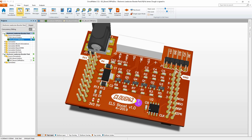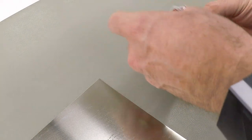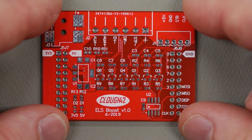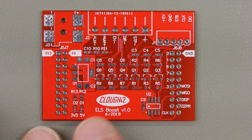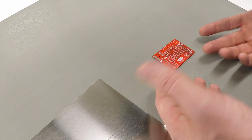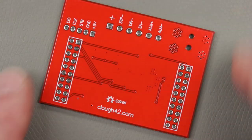I sent this design off to the fab, and through the magic of planning ahead, the boards are already back. These are the boards as they came packaged from the fab. I had these made at JLCPCB, which is offshore in Shenzhen. The reason I chose them is not because I have any affiliation with them — I don't, and they don't pay me; I paid full price for these boards. The particular combination of the size, the number of boards I wanted, and the features — specifically the red solder mask and the lead-free HASL finish — they had the best price and could turn them quickly.